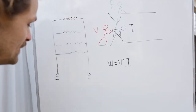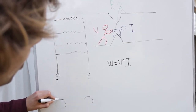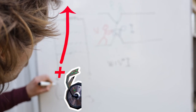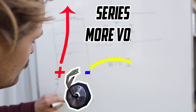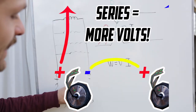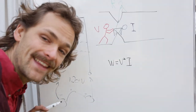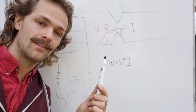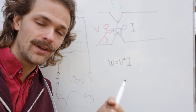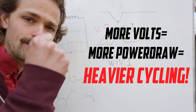To do this, I'm going to put the generators in series - generator 1 and generator 2. The positive terminal of generator 1 connects to the positive terminal of the system, the negative to the positive terminal of the second generator, and the negative terminal of the second generator goes to the negative terminal of the system. That would make these generators able to generate around 120 volts. When the voltage goes up, the amps also go up, and I have to cycle even harder, so we can see how much power I can actually generate instead of being limited by just the speed.